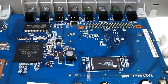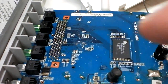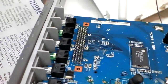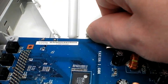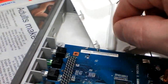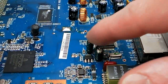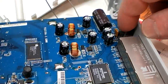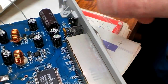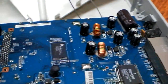I'm not too impressed. There are lots of solder splashes — you can see some right there. Dry joints all over the place, and the DC input jack looks like it's been through a flow solder bath. It's all covered in flux. It's a bit untidy.